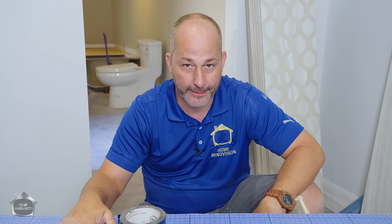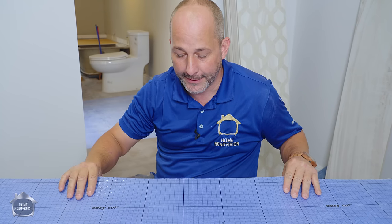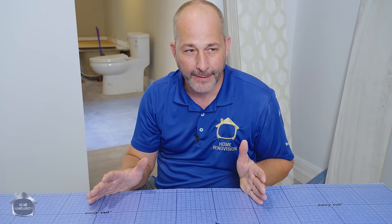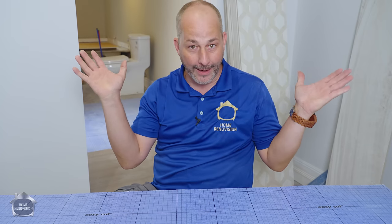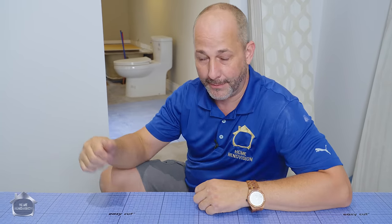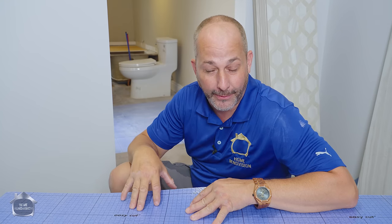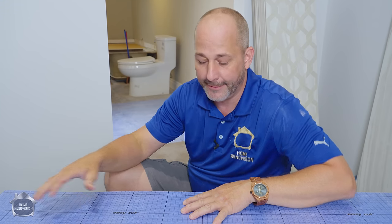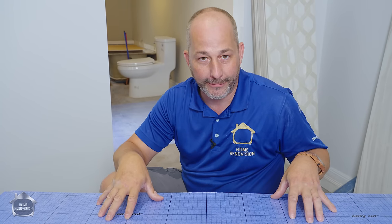You can use this anywhere in your home — under cabinets, under furniture, no problems. It can be a moisture barrier if you need it, just add tape. And here's one more place you can use it that we haven't talked about yet: you can install this on top of heating flooring systems. Big bonus. So if you want to do a bathroom like we're doing here, my tile already has a heated floor system and I'm going right over top with engineered hardwood — that's possible with this product. You add a dimpled membrane, the heating cable, a little floor leveler, then put this right on top, and you can have a heated floor system. No problems.